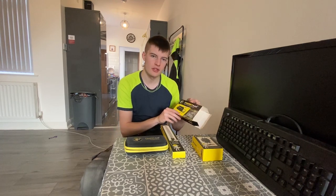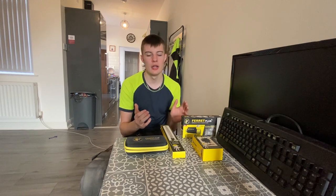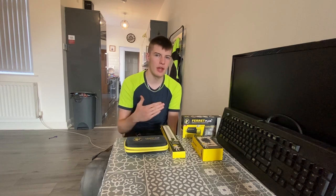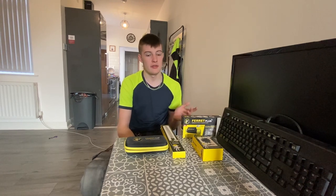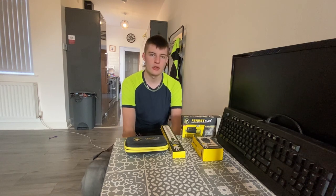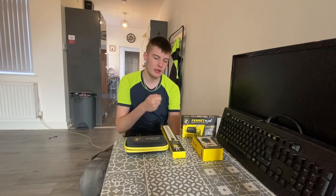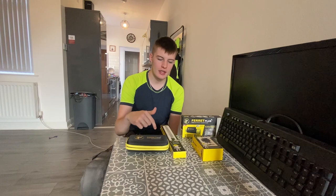Currently in the house we've had to leave part of it on as we need to keep power to the freezers and stuff. It's a rewire — they've moved out but they've still got bits and bobs there, so you need to keep some power on safely. We'll show you the non-contact voltage indicator where you push it up to a cable and it shows if it's live, a bit like the little woo-woo pens.